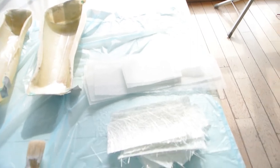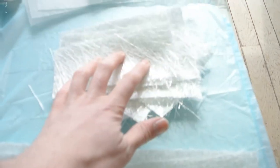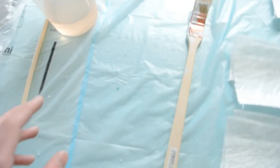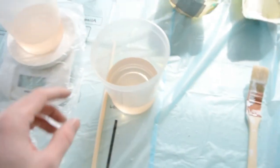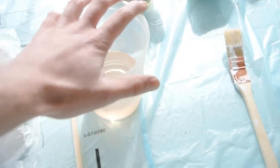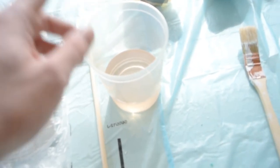Here I have a fiberglass 30-gram square weave just for the finish, then some heavy fiberglass 450. All of this is going inside the mold. This is polyester resin — I'll have to add a MEKP hardener at 3%. So if this is 300 grams, I add 3%, which is 9 grams.